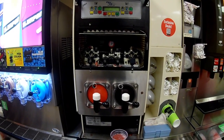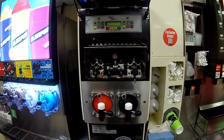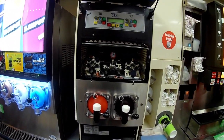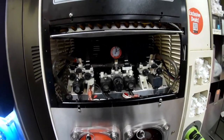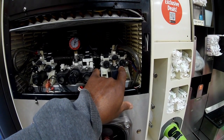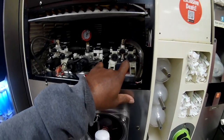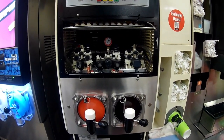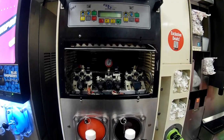I appreciate you guys watching. I look forward to doing more of these videos and getting into some more service repair videos for you. Thanks for all your support. The thing that was wrong with this was the brix was off — it was at about an eight or nine level and I had to adjust it up to 11, and then refreeze the barrel down. The next time you have a sugar-free flavor that you have to adjust the brix on, I hope this video helps. Thank you everybody, stay blessed.